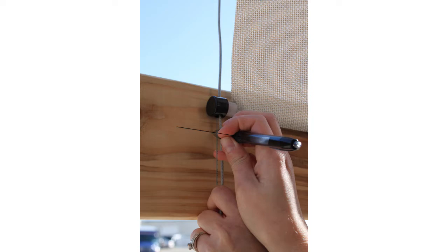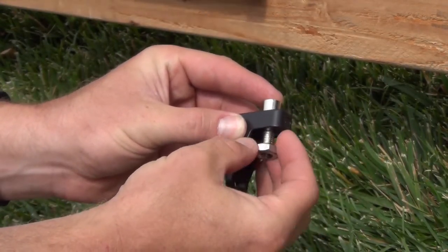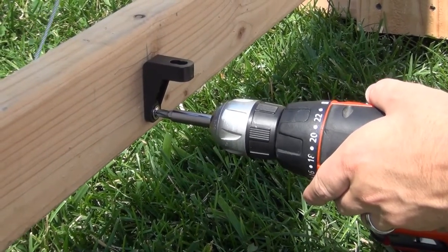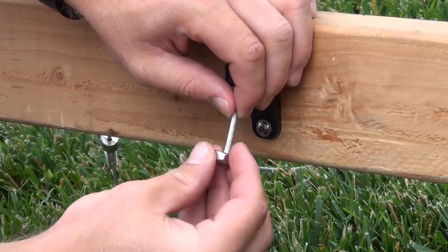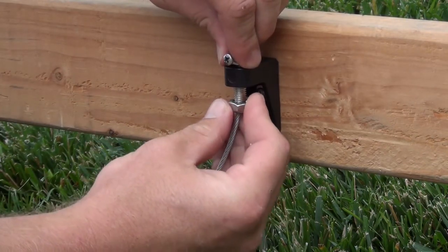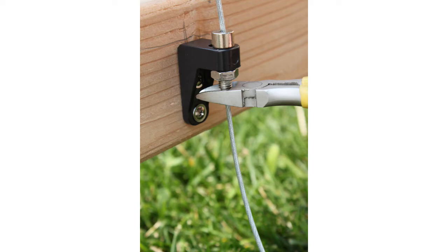You may need to roll the fabric up to complete this step. You will next install the cable bracket pictured here. Begin by removing the cable bolt and cable nut if necessary. Then align the cable bracket directly under the horizontal mark and centered on the intersection with the vertical mark. Use the provided 1-inch screws and install your bracket. Loosen the bracket lock screw and thread the cable through the cable bolt. Pull the cable taut, slide the nut over the bottom of the cable, then insert the cable bolt into the cable bracket. Tighten both the bracket lock screw and the cable bolt nut using a wrench. Cut any excess cable slack underneath the cable bracket with wire cutters.